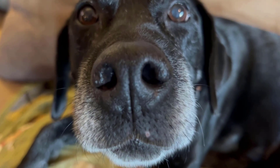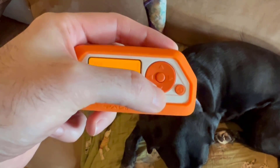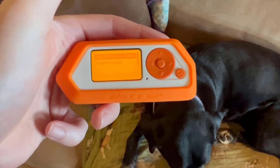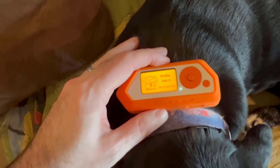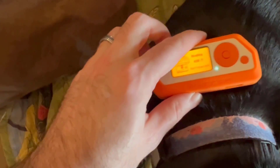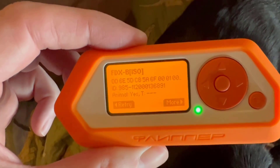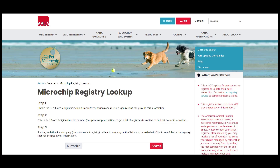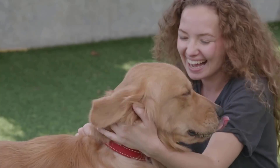Another fun project was utilizing the RFID antenna built into the Flipper Zero, designed to operate at 125 kilohertz. Most dog chips operate at around 134 kilohertz, but the Flipper can operate between 110 and 140 kilohertz with some shorter reading distances. There's a site online where you can put in your dog's ID tag, and if you found a lost dog, you can actually reunite them with their owners using the Flipper Zero, which I thought was really cool.